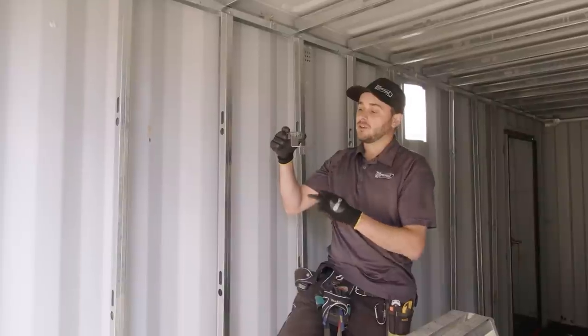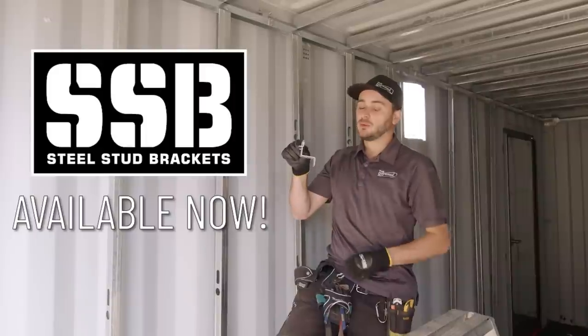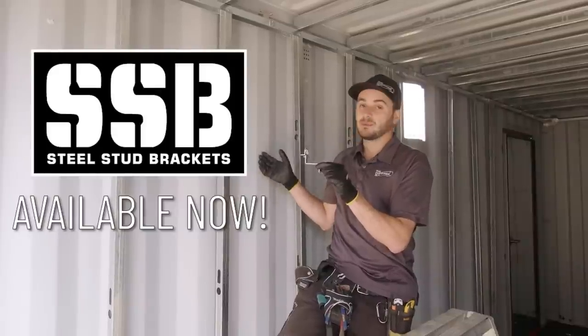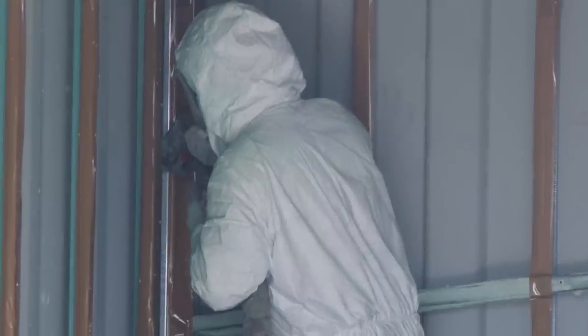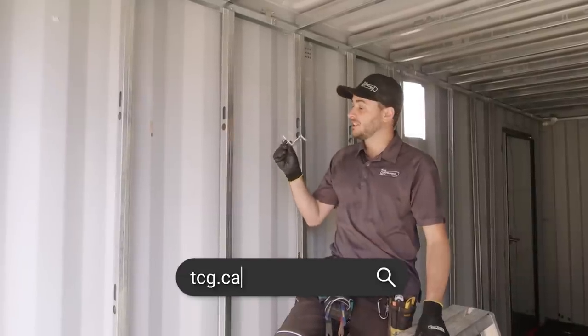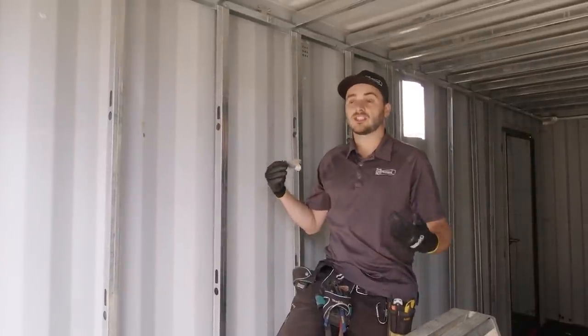This is meant for a two-and-a-half-inch steel stud to sit flush against the inside corrugations, which I don't really like as much as an inch-and-five-eighths steel stud, which is seven-eighths of an inch away from the inside corrugations. Now you can get a nice layer of foam all the way around all of your interior studs and you don't have any thermal bridging. These things are awesome — they're legendary. They're going to totally speed up the time it takes for us to get started in framing.